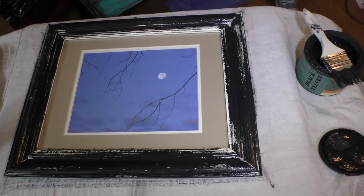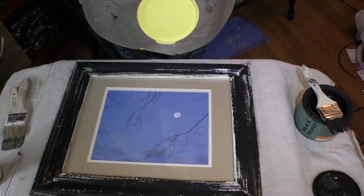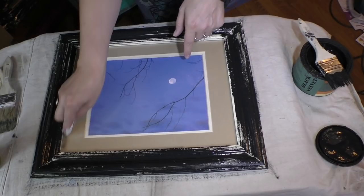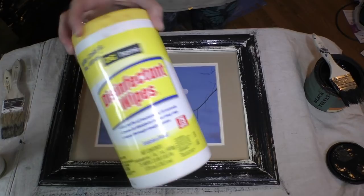Here's a quick cheat trick: keep your Lysol wipes or disinfectant wipes — whatever they may be called. You don't have to be brand loyal, you just need a disinfectant wipe. If you see that you got any sort of paint on the frame, you can wipe it right off. As a painter, even when painting kitchen cabinets or furniture, if you see drips on the floor, these will dissolve them and take them right off. They're an amazing product to help break down your paint as a shabby painter and keep you going.